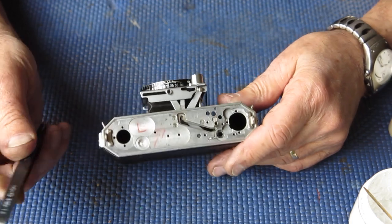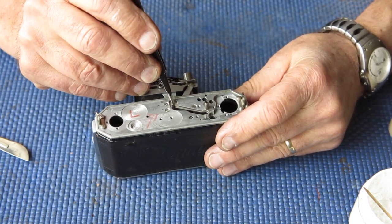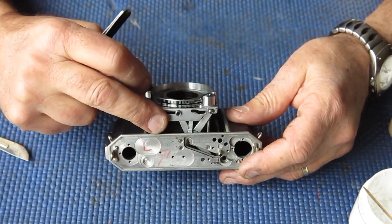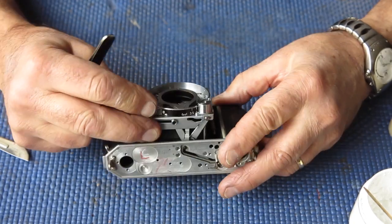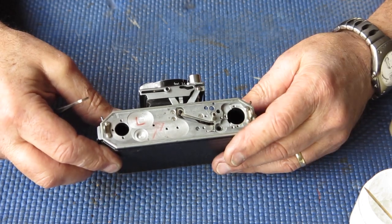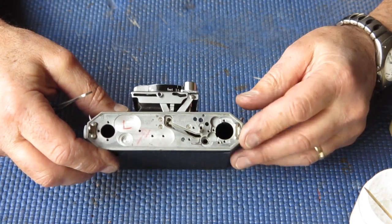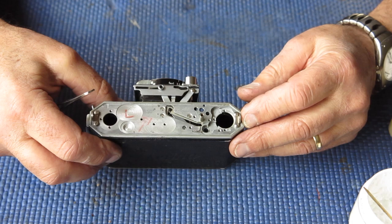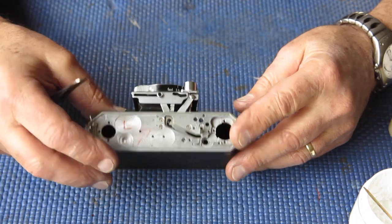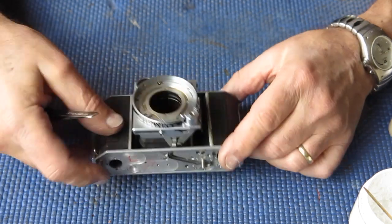Another possibility is that a screw came loose in the camera and was lodged in this slot, physically preventing that post from moving far enough forward, and so achieving the same thing as if the rangefinder was jammed. There was no loose screw in here, of course. I know that a screw was missing from the camera, but it was missing from the outside of the top cover. It's difficult to see how a screw could fall loose out of the outside of the top cover and then find its way into the camera and cause us grief. So it remains speculation as to what the cause was.